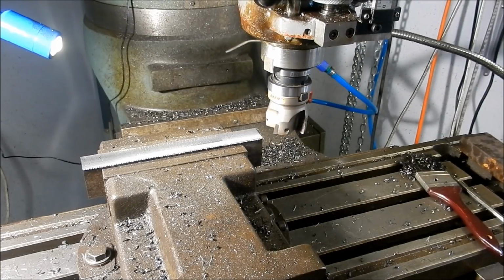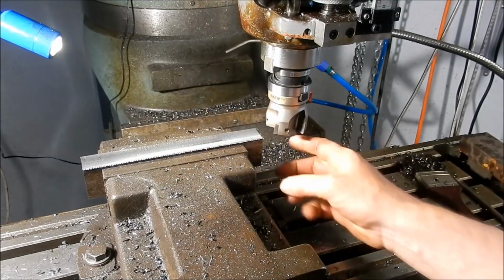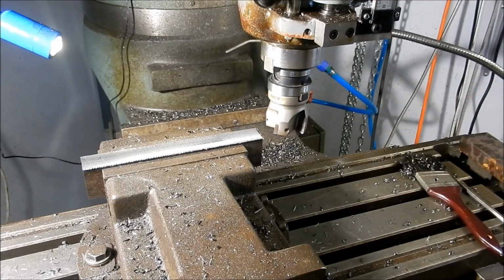Alright, that's a reasonable sort of finish. I don't think I'll go that way again. I've got chip shad all over the workshop, and that's got a pretty gnarly burr on that. I'll have to take that off with the belt on the grinder. Alright, I'll get this flipped over to the other face, and we'll start working on those, and we'll work this around till we get it down to about 0.2 over nominal size on all faces. Then I'll set up in the surface grinder, and we'll take 0.1 off each side and tidy up that face.